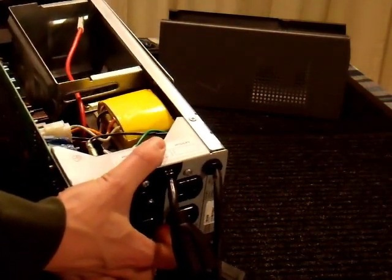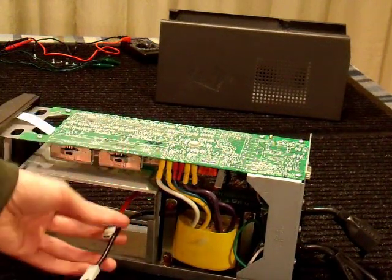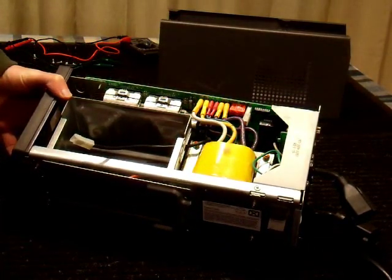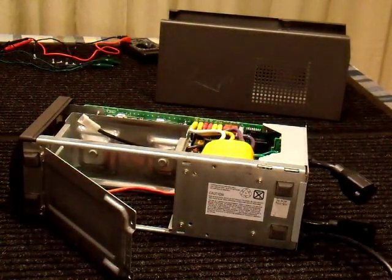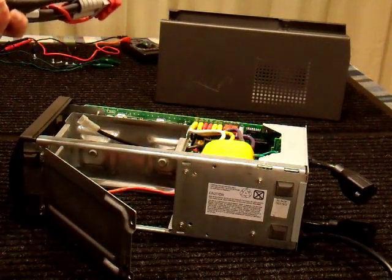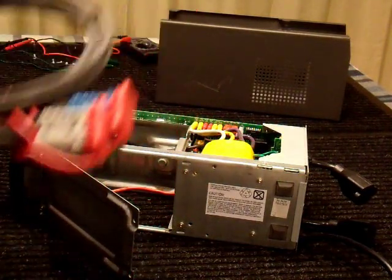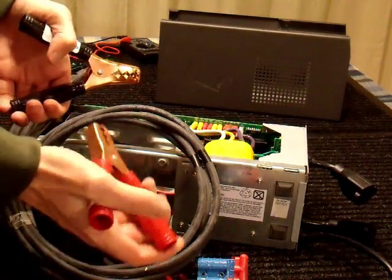The main problem right now is that all I have are these two way-too-small leads going to this thing, and I don't have anything to connect them to, so they're pretty much useless. I think I'm going to make a better cable — something longer, heavier gauge — so I can hook this to a battery whenever I want. For that, I have some eight-gauge high-strand-count copper wire that I picked up at a surplus sale. It has connectors on the end that I'm not going to use. I'll hook that up and put a couple of clamps on it so I can connect it to whatever battery I want.